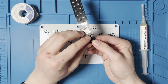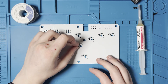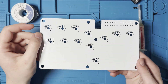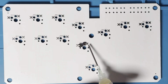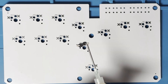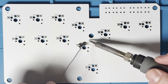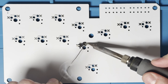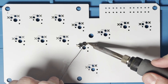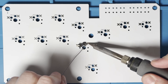These hot swappable modules are really easy to install. They have plastic legs on them so they simply push into the PCB. Once they're all lined up you can just hold it down with your finger and push in some solder after heating up the pad with your iron. These are easy to install but on this board there are 11 of them to solder, so it did take a little bit of time. I had my iron set to 380 degrees Celsius and I used some 60/40 tin-lead solder with some MG Chemicals liquid flux.